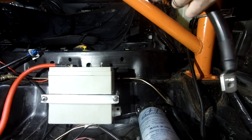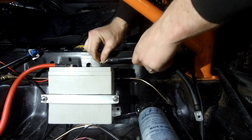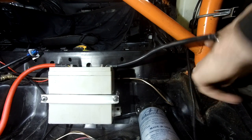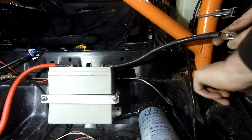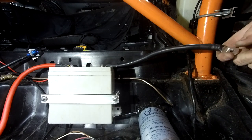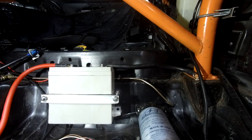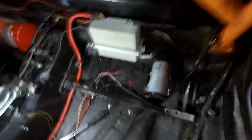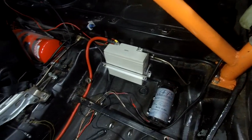In here this end goes obviously to the battery, and this end I am going to be running to the roll cage foot. I've already taken the paint off there to expose it for a good earth, and then promptly lost that bolt — here we are, ta-da! Wrong tool for every job. Battery in, meth pump remounted, all looking pretty smart I think.